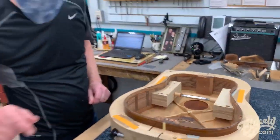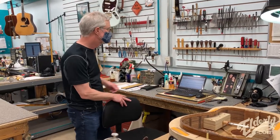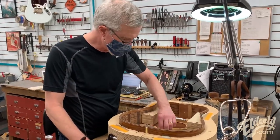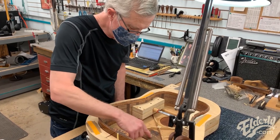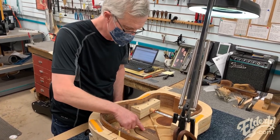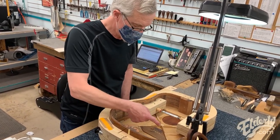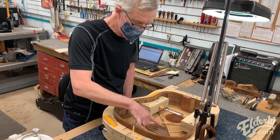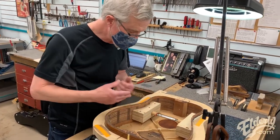Since the knives are getting up to temperature, we'll continue on that. I'm going to grab a brush for getting the warm water where I need it. I have pretty much all of this X-brace up to the joint, and about half of the large rosewood bridge plate, which also includes the bridge pin holes that are plugged and re-drilled. I've got two sets of bridge pin holes and a hole that was previously for the bridge doctor, as I mentioned before. Just working my way through all that.